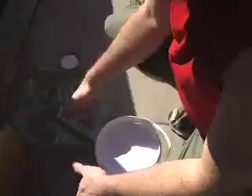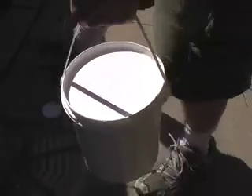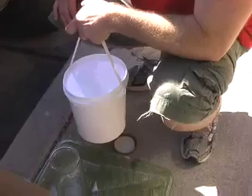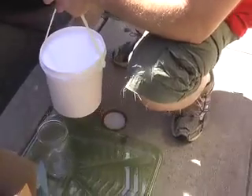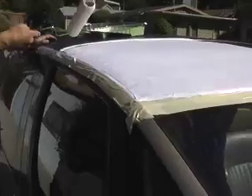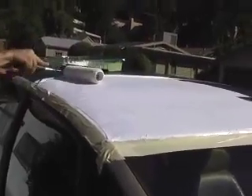We've got the Hyperglass Seal open — it's nice and thick and white. This doesn't have to be diluted normally, but we're going to dilute it by just 10% for the first coat to get superior penetration. It penetrates as thoroughly as water at that dilution. When that dries, we'll put on a second coat. We're rolling on the first coat now — it rolls on pretty smooth.